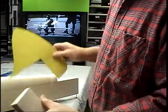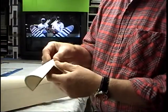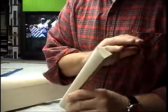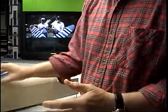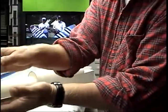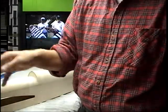But if you do it that way, then the last thing is I have this piece in my hand. And I want to explain this ahead of time, because if you start doing it some other way, if you build this rudder first, it just gets out of control and you can't fit everything up. It's like when we attach shells, I try to start at one end of the ship and work to the back, not start in the middle and get to both ends and they're both wrong.